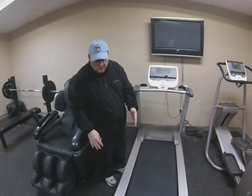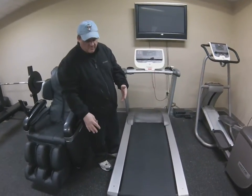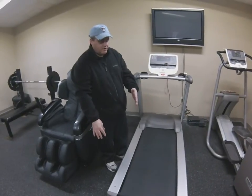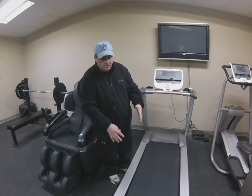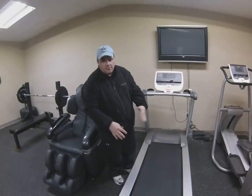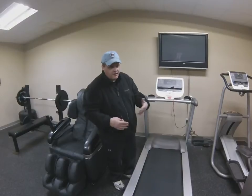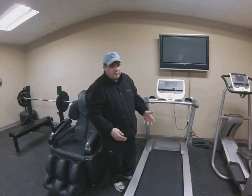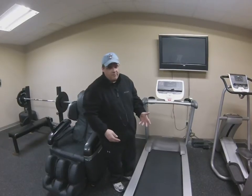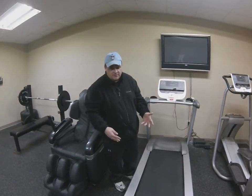The extreme case is when the belt comes off track entirely. It might come off track because of a structural problem with the treadmill — when I say off track I mean off the edge of the roller — and the machine will continue to run and chew up the edge of the belt. The machine might not be on level ground, it might have a bad deck cushion, it might have a bad roller. There are lots of reasons this might happen.